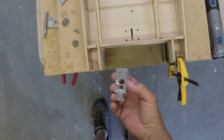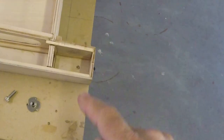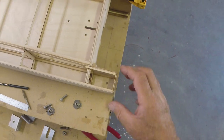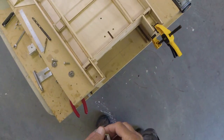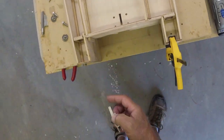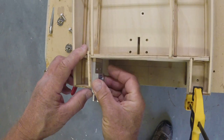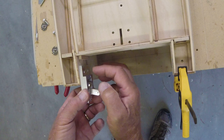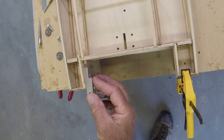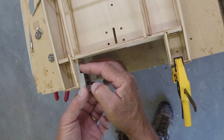So what I've done is I've actually cut a piece of 1/8 and I glued it on the interior here. Okay, and it's glued really thoroughly all the way around to make this super duper strong. Put a 1/4 inch block here because I want a thing for it to butt up against. If it's not butted up against anything, then it's just relying on these screws, and I believe the bracket will probably start to move. If I put it here, it cannot rotate easily.